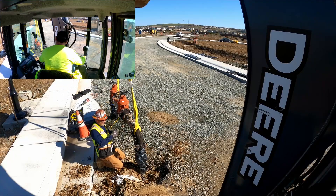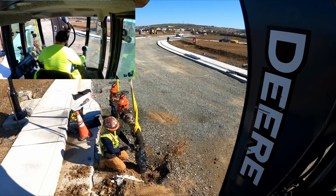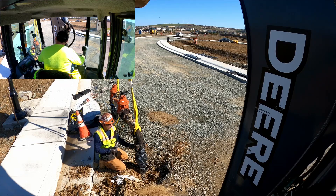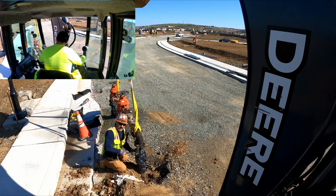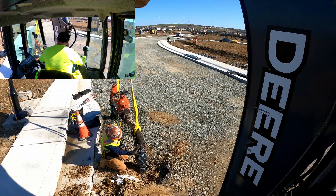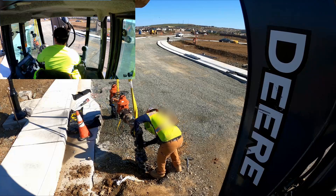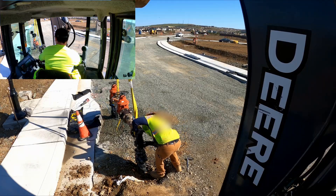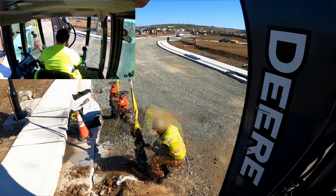Now that I'm in position, I'm strapped up, hooked up, and Andy's going to continue unbolting the rest of the backflow preventer so I can just pull it off. I'm holding it so we don't have to worry about it falling and hurting him. He's got to unbolt all the stainless steel T-bolts and then start loosening up the mega lugs with a hand wrench. Once that's done, it'll be free for me to yank off.